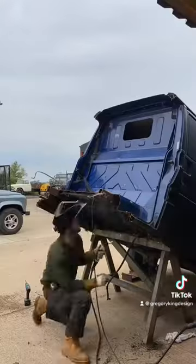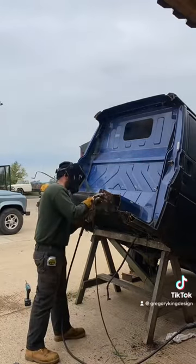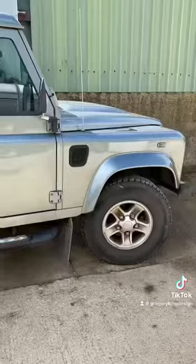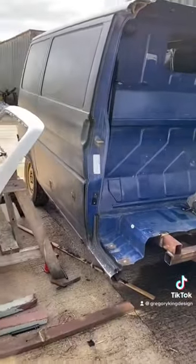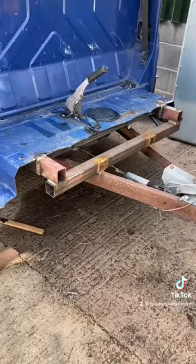Making up the A-frame and getting it welded up. I then decided to put in some tubes and sleeved these inside the original boxing panels, then plug welded the sides to make it nice and strong. As per usual, I decided to completely change the design halfway through and changed over to steel channel.